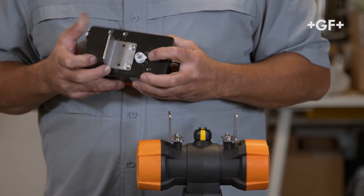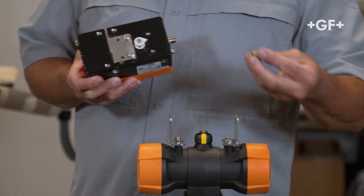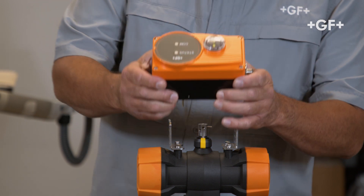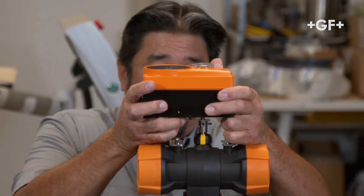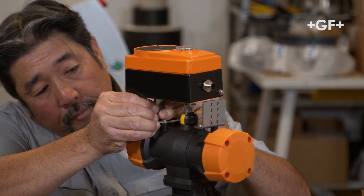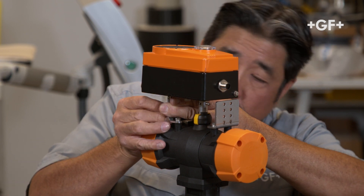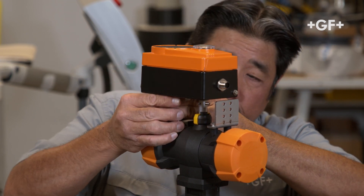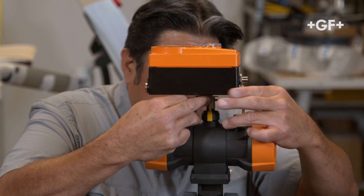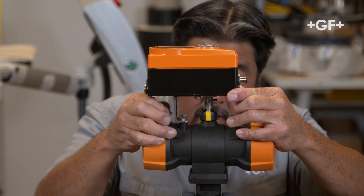Next, I want to pull the pivot indicator up far and use it as a guideline — a depth indicator — for how far into the adapter my spindle goes. I'm going to set it on top and line it up with one of the screws. Lining up the holes, I should be able to get one of these in place. The pivot indicator is now a good guideline for the depth of my spindle adapter.